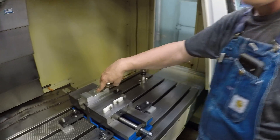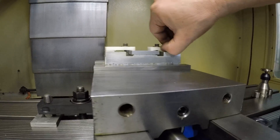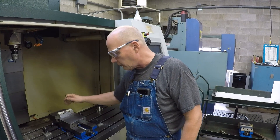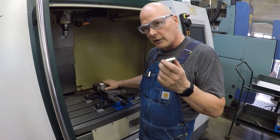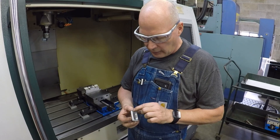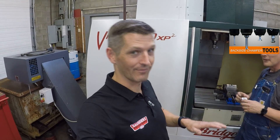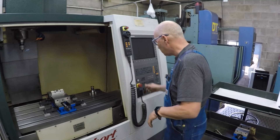I have a hole in the center here, so the initial clamps are made out of nylon. Right in here you can see there's a relief underneath so it's only clamping over top where there's metal underneath — no distortion. The nice thing is when you take your raw material, if you've machined the fixture to whatever the finish size is, you can get it centered up by just feel and finger. You can machine it completely finished, put chamfers on it, and do everything you want to do. You can also take a lollipop cutter or bevel cutter and cut the bottom side chamfer.